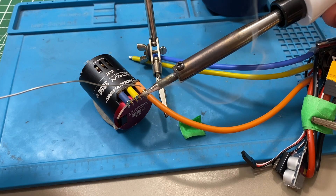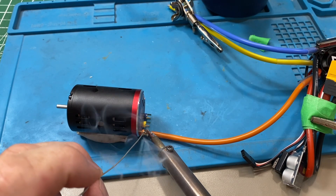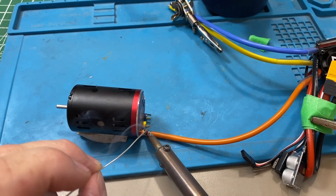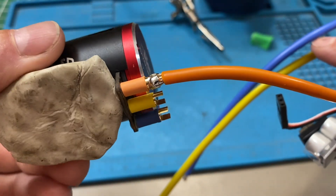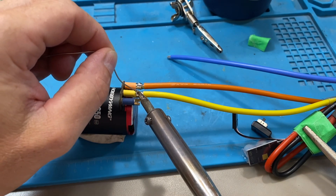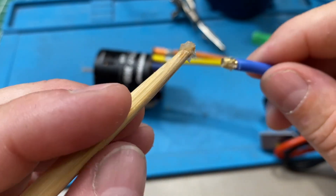You can file it down if you're brave. After doing the top side, I like to just check the underneath since it's a U-shape. Fill any voids with solder. That looks pretty good to me — not the cleanest, but it is shiny and it's all filled in. Continue for the other wires. Make sure they go in the color-coded position. Just using my trusty chopstick to apply some flux to the end of this lead.